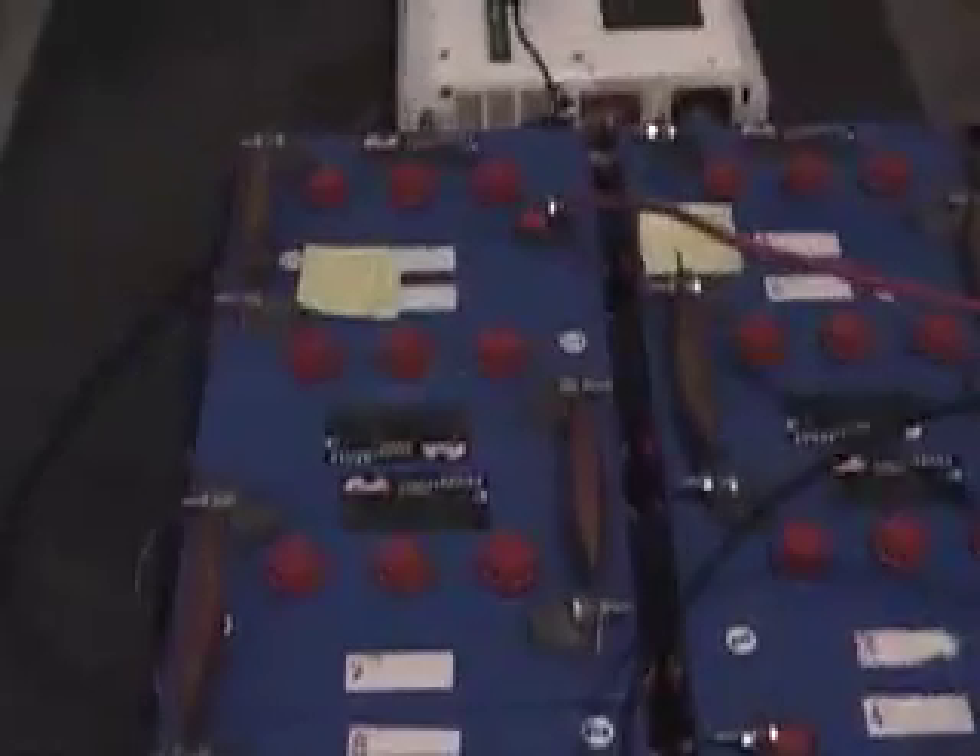It's charging but the only problem is it's taking a long time. With this setting — 8 ampere drawing from the primary battery — with 20 ohm. If you put 15 ohm it does like 9 ampere, it charges a little faster but the light bulb comes on a little bit. I prefer 20 ohm but it's taking like 48 hours or even more.